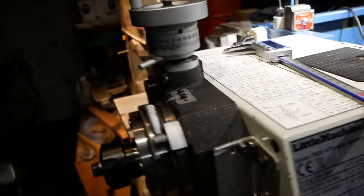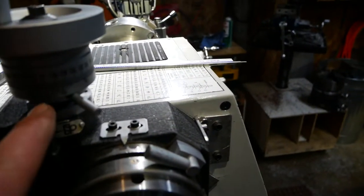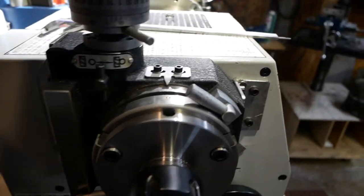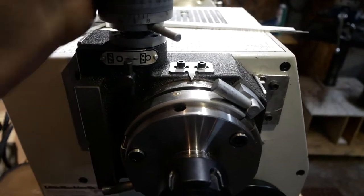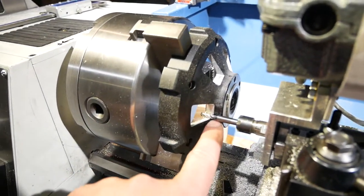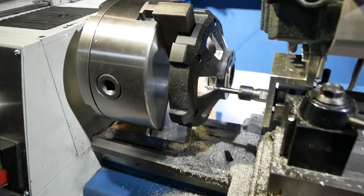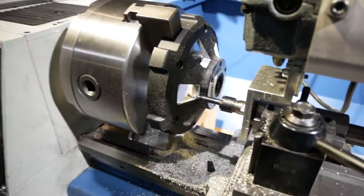Now I need to go reverse, same thing again. Right now I'm at 130 degrees here and zero is there. So now I'm going to go reverse. There's 10 degrees, and here's coming up by 20 degrees, and back to double zeros on the 10th scale. So I'm back there, and now I am dead nuts into that corner right there. I guarantee you there is no deflection on this bit. I can do this absolutely blind because everything is dead nuts, right?